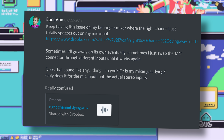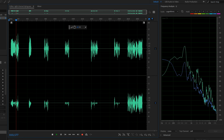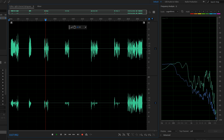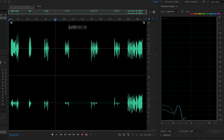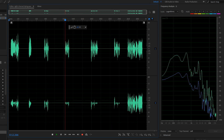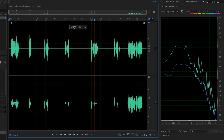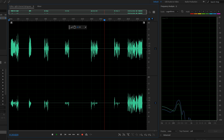I've also run into issues where sometimes I'll go to record my microphone and one of the channels is totally glitched out and staticky or just not there at all, usually the right side. This only happens with the microphone inputs, even though they're mono. I usually have to power cycle the mixer or switch inputs enough until it resolves. All of this seems to point to bad capacitors in the mixer, a common problem with cheaper solutions. Just funny given their whole award-winning preamps selling point.